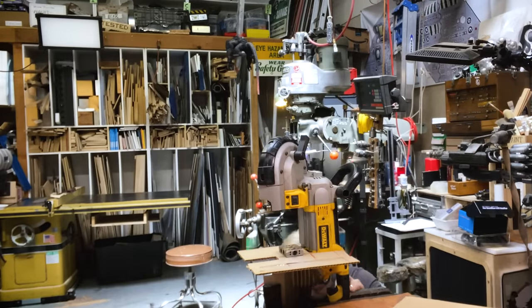All right. Now I'm gonna make this hole for the main blade out of a 1¾ OD Milwaukee hole saw. A hole saw for metal, you say? Yes, I say hole saws can do all sorts of wonderful things. Just ask anyone who builds roll cages inside of cars and they will tell you about hole saws' abilities with mills to do notching and all sorts of remarkable things, as long as you are going slow on the spindle speed and using lots of cooling fluid. But I'm gonna stop having you look at my pretty face and we'll get a close up on this so you can watch it happening.